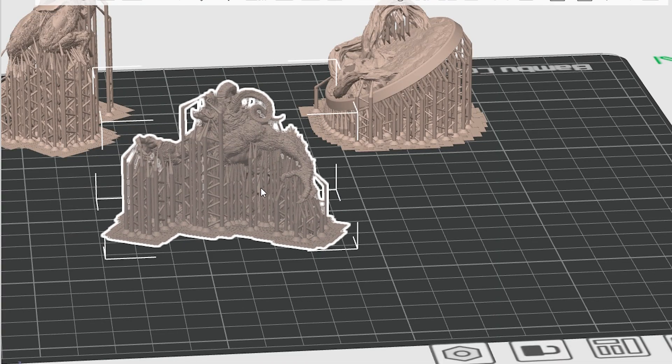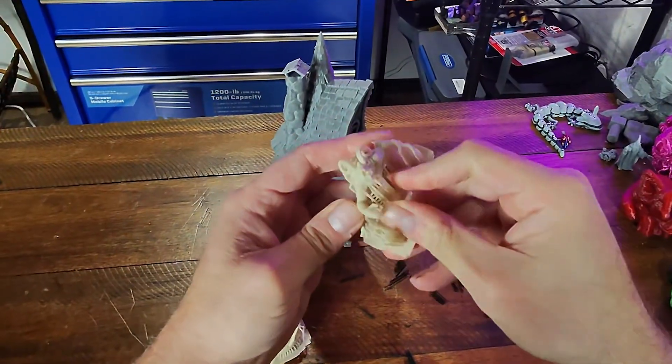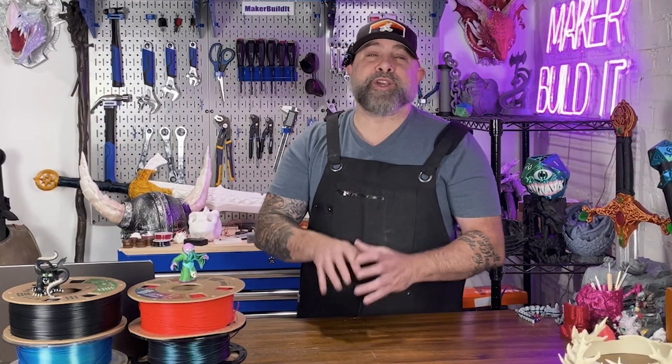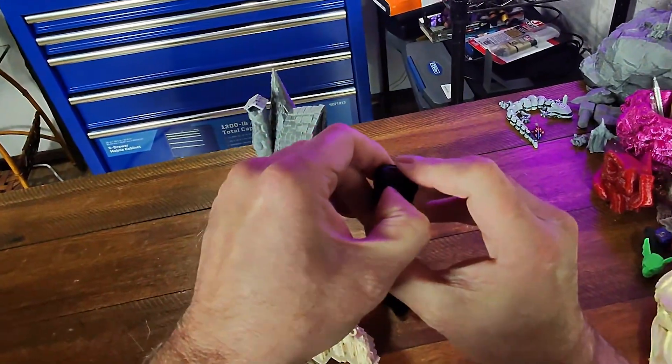Be smart with your supports. Supports are like that one friend that really means well, but always overdoes it. For instance, Loot Studio actually has models that come with supports, and those may be a good option. But if your printing model doesn't have supports, tree supports is usually the way to go — or even use custom supports. That will help eliminate big scars on your miniatures. And if your slicer has support interfaces, use them. They'll make the supports peel off like string cheese instead of ripping apart your miniature.